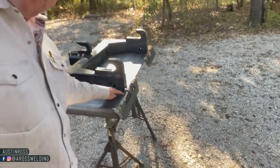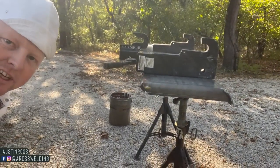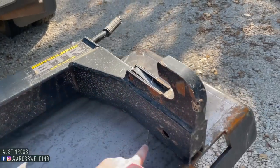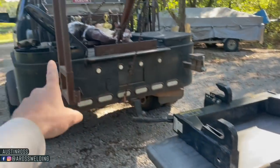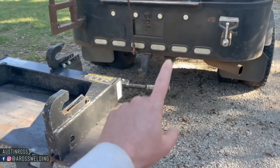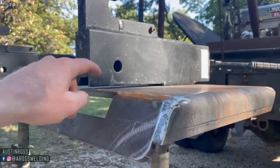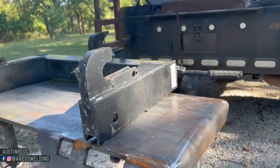It's just a nice little option he's going to have. Literally all I'm doing is flushing this up right here at the bottom, just like so, and whatever sticks out at the top is whatever sticks out at the top. I'm going to put a weld here, here, inside, inside, here — same on this side — with 7018. First thing I'm going to do is fire up the weld machine, get four tacks, then take a wire brush and brush all that paint off. I'll have a little gap here to weld — it's probably three-sixteenths gap, so I'll just fill that with my weld.